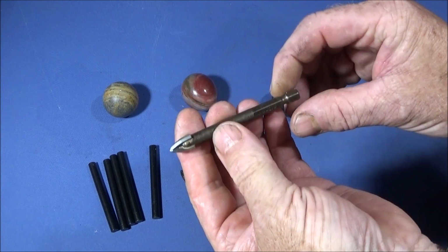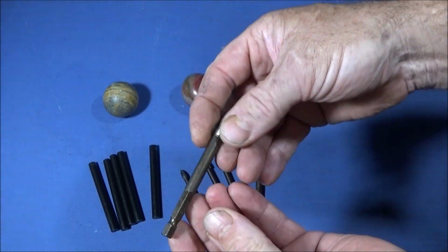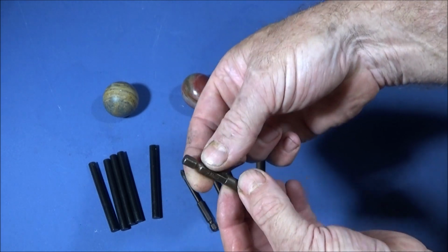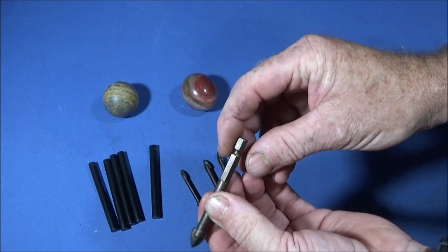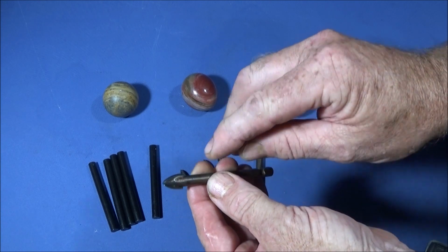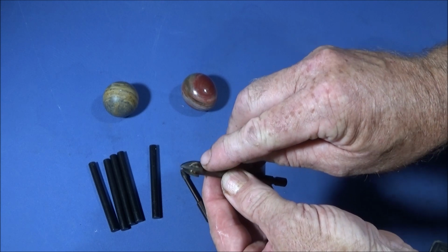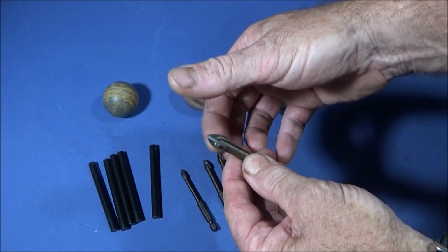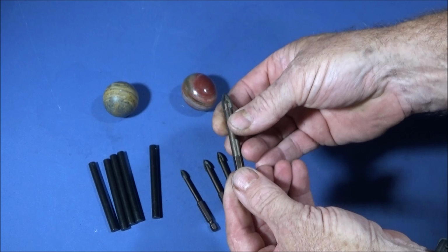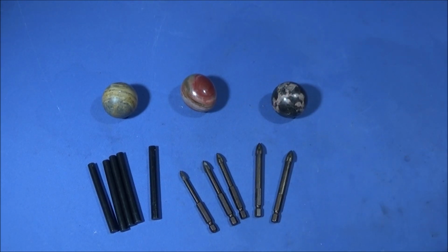And these cutters do look very well made. They're 4-fluted carbide brazed into the end here, and you have the hexagon here for the normal drill so it can actually hold on that without slipping. It looks very well brazed. There's a nice witness of braze all around and they feel very sharp. And I'm going to be trying these out today on the Chinese Mini Lathe.